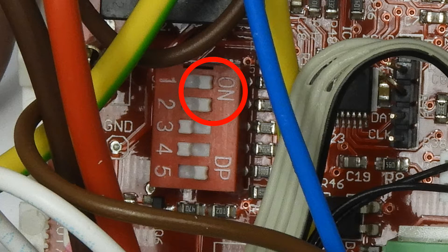Followed by the second two dip switches to the off position, which is to the left-hand side, and the final dip switch to the right-hand side, which is the on position. Please use the three-core cable which is supplied as part of the Whale kit in order to make the connection between the Whale transformer and the Triton shower.